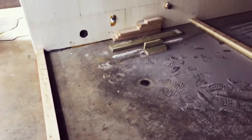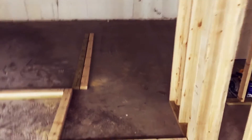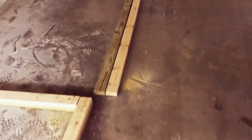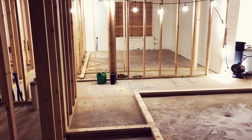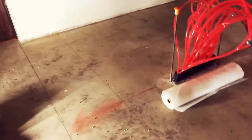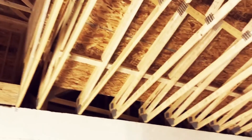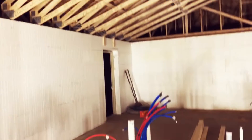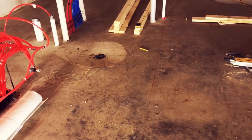I got the laundry room done. I got that little door between the bedroom and the hallway done. Looking back, I wish I would have actually extended this bathroom a couple inches so that these two rooms would have been flush with each other — probably too late to do that now. I still have to figure out this rake wall. I don't think I can do layout the same way, because even though I can lay the boards on the ground for the bottom plate, the top plate has to be cut to length, and the top plate's not going to be the same length as the bottom plate because it's on a slope.